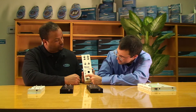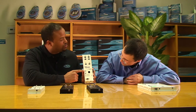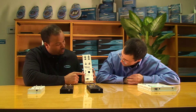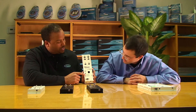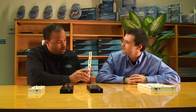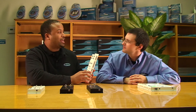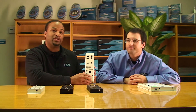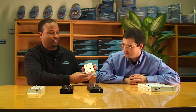The 4x2 has a similar configuration: manual switches, RS-232 control, and two-channel or multi-channel surround. There's also an EXT IR port on the side — an external IR optional piece that lets you place an IR receiver away from the unit itself.